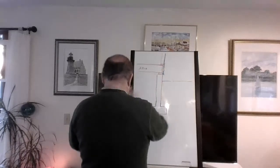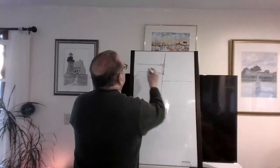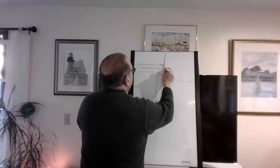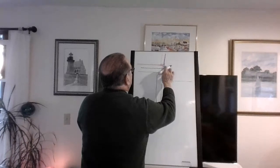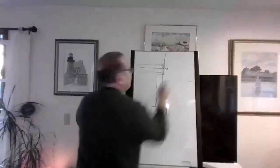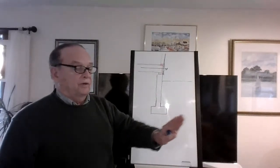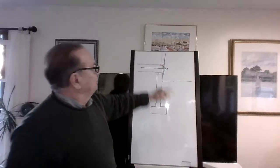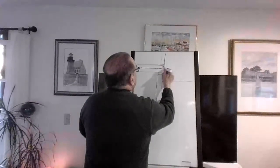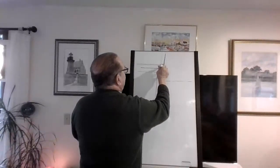So your outside faucet is going to look kind of like this here. It's going to come out here and then down. Now I'm going to make it a frost free. So that's how you can tell a frost free, by the way. The handle is going straight in. It's not coming down at an angle, like a 45-degree angle. If it is, it's not a frost free. Most of the guys now are putting in frost frees. Okay, and your frost free, by the way, is like this. And the washer for this is back here, right about there, right?